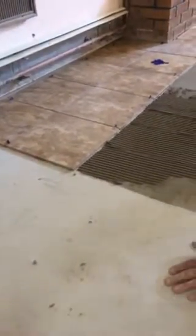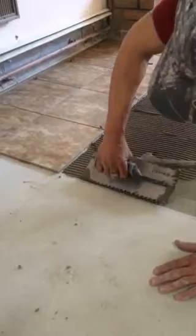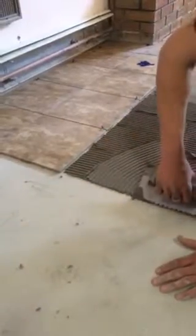So we ground the floor yesterday with a grinder to remove all the sealer off the floor. One of the other rooms had some paint in it and we removed the paint off the floor as well. We snapped our lines here and found a 3-4-5 pattern to ensure that we were square, and we're starting our first lines across the back of the wall and then we'll be working our way out.